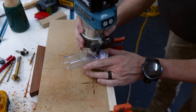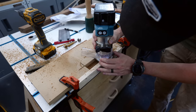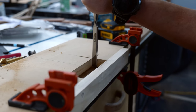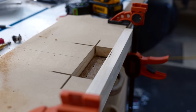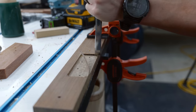I wanted to make sure that we had a proper seal and that everything was being compressed evenly and the right amount, because with these seals you can over compress them, or worse, you could even under compress them. But either way, we want a really tight seal to start off with, so as things wear in, this thing remains watertight. Now I set up a quick little jig using the router and a template cutting bit. Super easy way to cut a pocket out here.